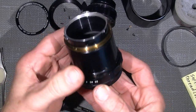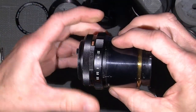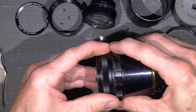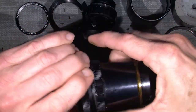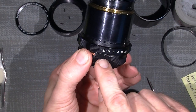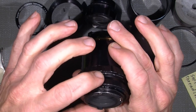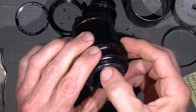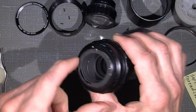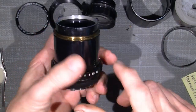And of course, if you only want to take out the whole thing here, you do not really take off the aperture ring, but there's something you should know. There is a tiny steel ball in here. So be aware of where it is. It sits there, on the opposite side of where the auto manual button is. So if you turn it over, you will see it here. It's very close to the pin here on the back. Not a pin, but I don't know what it actually is, but it doesn't matter. Just so you know, it's this close to that. But there's no reason to take it off if you only want to take out the aperture plates.